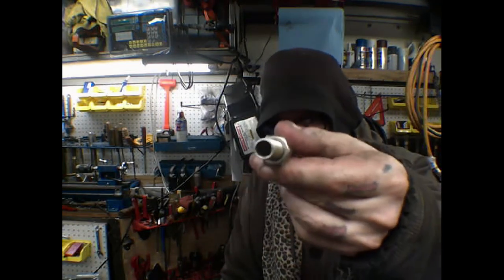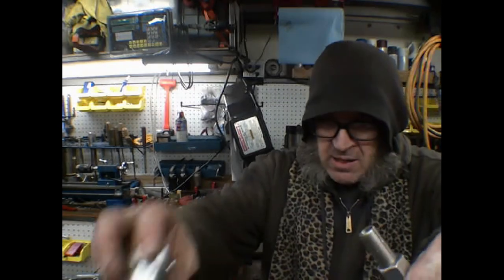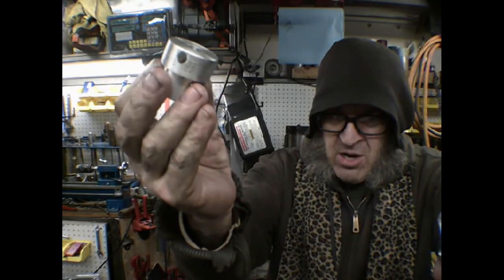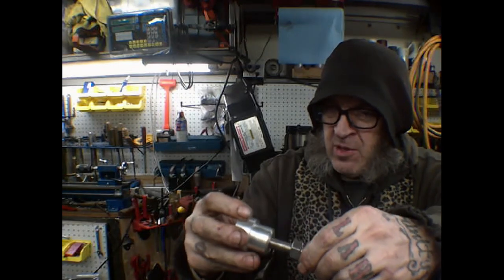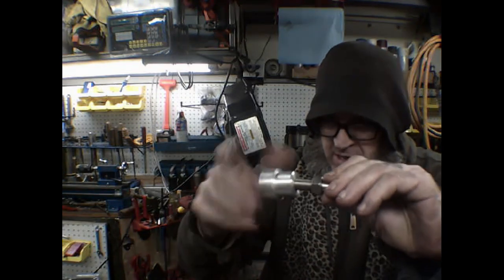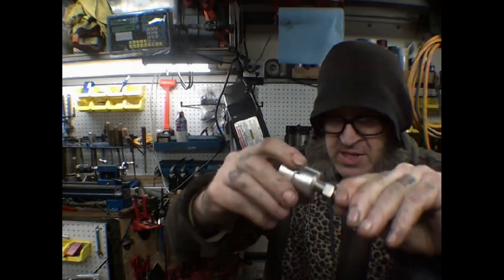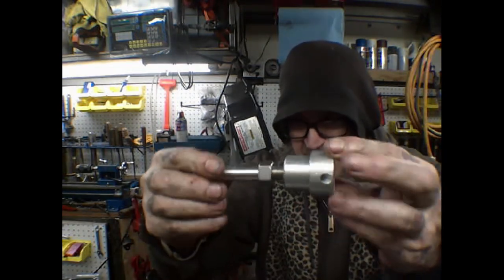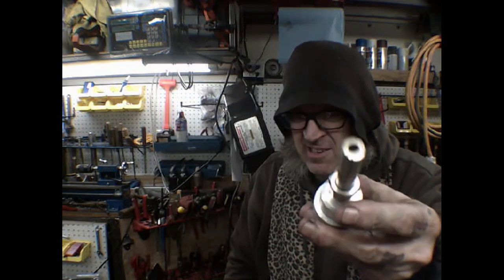All right, figured I'd take a quick break. This is reamed to 375 thousandths, 3/8. The handle has the air nozzle put in there, so yeah. I haven't made the piston or anything yet, but it threads together the way it should. Well, my hands are all oily, but whatever. It threads together the way it should. And I've yet to start working on the hammer end.